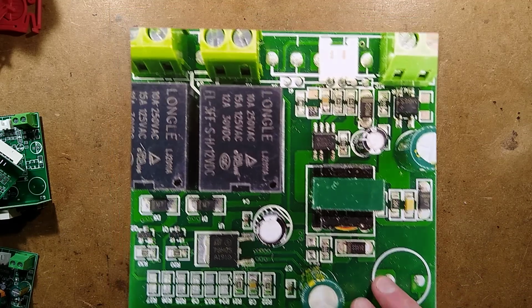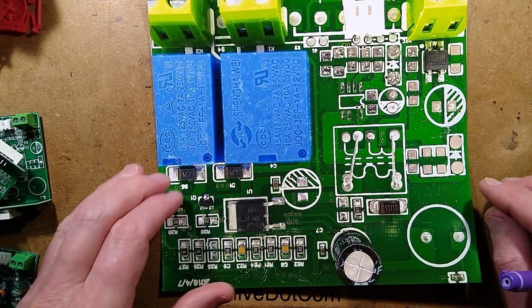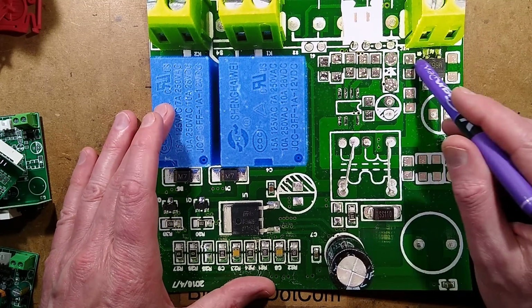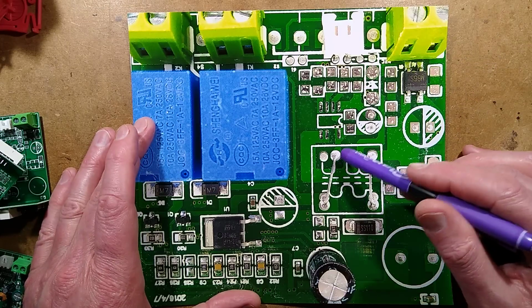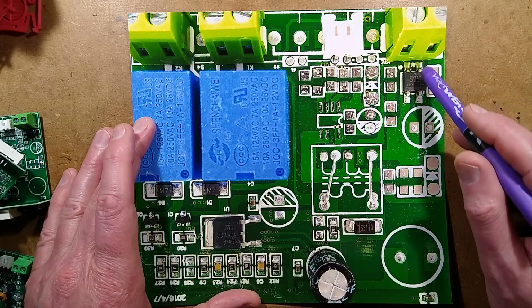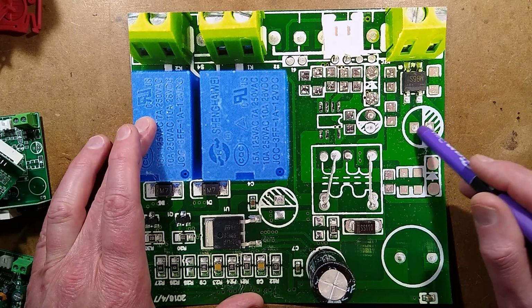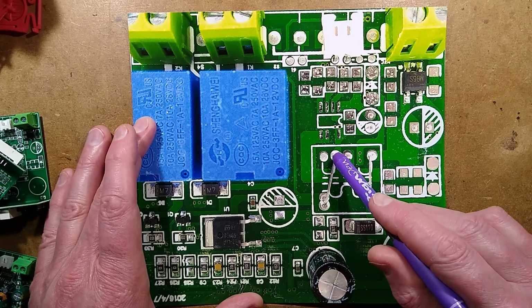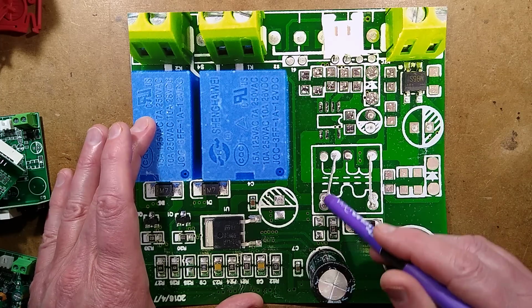Let's take a look at the lower voltage one with what look like better quality relays. They're bigger. Not sure about the brand. Shanghai. You can see all the component layout as if it was the other one, but instead of actually having the mains voltage circuitry, it's got the low voltage coming in, going through the bridge rectifier, and then it goes, because that would normally go to positive and negative, and because the primary winding would normally have the positive, and the bootstrap winding would normally have negative, they've just taken a link from those over to the other side. One of those then provides the negative.